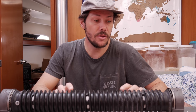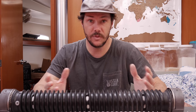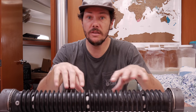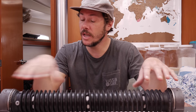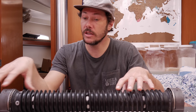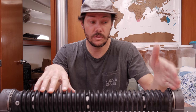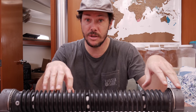The more I thought about the solution that was put in, the less satisfied I was with what Z-Spars had come up with. This is designed to have bearings at both ends for a reason. Even on an in-furling main, you will still from time to time adjust the tension on the main halyard. And the second you reduce some of that vertical tension from the main halyard, that's going to cause the screw to put pressure on that bottom bearing that should be there.